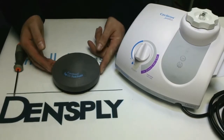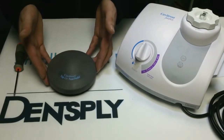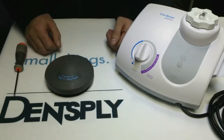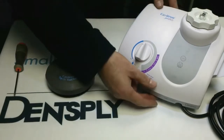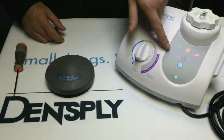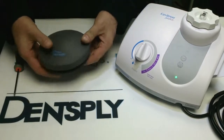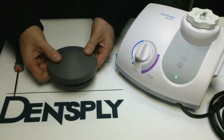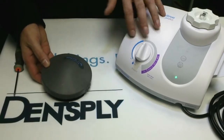The reasons for synchronising the footswitch may be if the unit has gone back for repair at any stage and the footswitch was not supplied back for the repair — we would have had to synchronise it with our own footswitches here. So when you've got the unit back you'd experience this problem: if you turn the unit on, wait for it to go through its power-up cycle and then activate the footswitch, there's no response from the machine at all. This is because the wireless link is not established between the footswitch and the base unit.